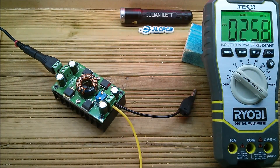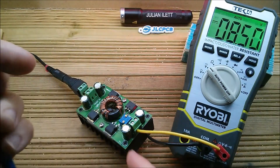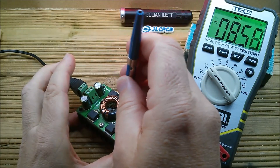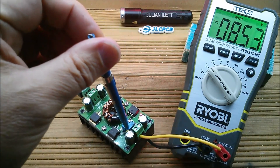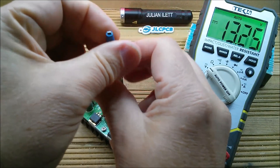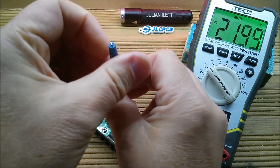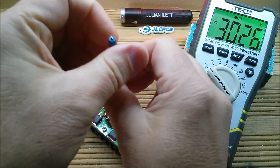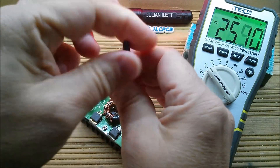Anything's got to be better than meter probes. We've got 8 volts coming out. My guess is that little red LED is directly across the output, so it should tolerate whatever the maximum voltage is. Here's the CV adjuster — I set the pocket screwdriver so it's in the same orientation as the blade inside to make it easier to find. Let's wind it up; I've got about 12 volts coming in from the power pack. It's a tad over 30 volts at the top.